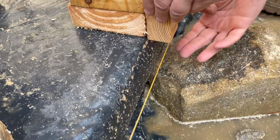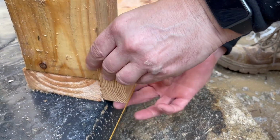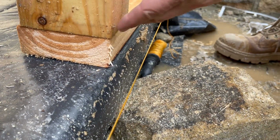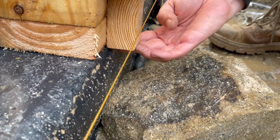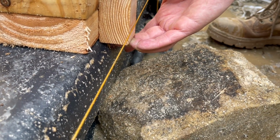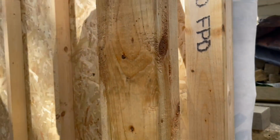There you go. And what I'll do now, I'll slide this wall backwards off. Right, let me exaggerate, John. There. Right, so you can see the block isn't touching the string line, which it needs to. Right, Liam, kick it forward. And then what we're going to do is push that forward. Ease up. No, that's too much. Until it's in line with the string. There you go. You're there. And that means then that both of them walls are running through with each other.